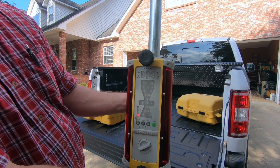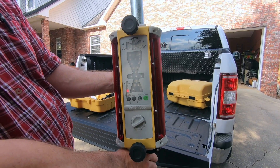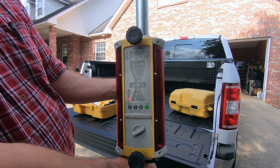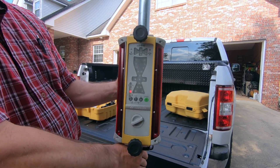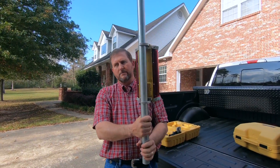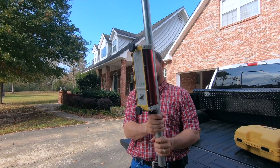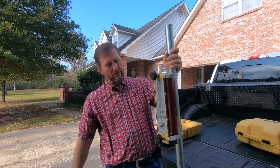Low sensitivity. You're even on grade. When you tilt your dozer blade over, it's telling you you're off to the left, then you're getting real close, and then there's even. That's what the machine does, and it reads 360 degrees, so the laser can be anywhere around and it's going to pick up the signal. It worked really well.